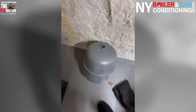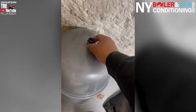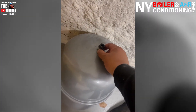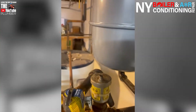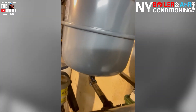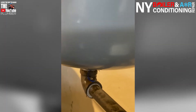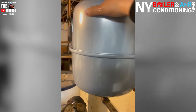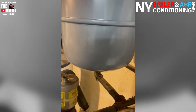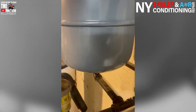I took out the other tank. Screw on — it's very simple. You can use channel locks or an adjustable wrench, grab it from the neck and loosen it up. Righty tighty, lefty loosey. You want to screw this to the right as you're tightening it and you'll feel it gets tighter and tighter. As you can see, it's going into the half inch elbow. As I tighten it, it gets harder — you don't have to be He-Man tight, as long as it's snug enough. Finish with some channel locks or adjustable wrench.